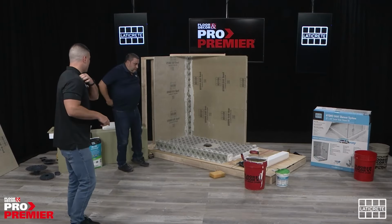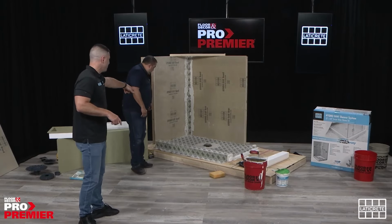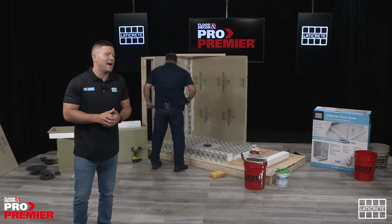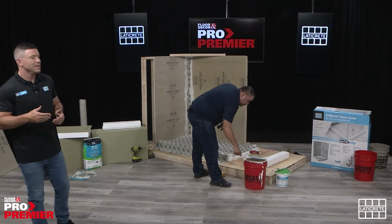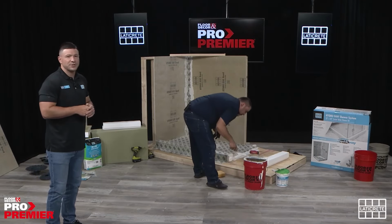So with that, we'll start with, again, the adhesive and sealant in the bottom left-hand corner. So Adrian's gonna take that caulk gun, literally shoot a liberal bead between the two planes, and flatten it out with either the flat end of the trowel, the margin trowel, whatever your tool of choice is, which can act as that flattening agent to bring the two together.